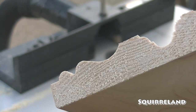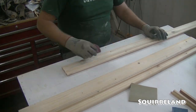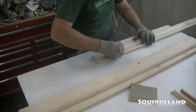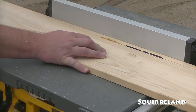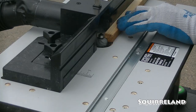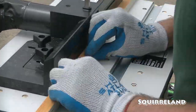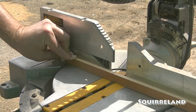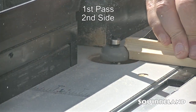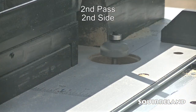Next up are the two trim boards that will be on either side of the panel. The reasoning I have behind this is that I hate visible seams when I assemble my wall panels — it takes away from the illusion when I'm easily able to tell that the room is a collection of four foot wide sections. My solution is to make the seam part of the design and hide it by drawing attention to it. If it looks like it's supposed to be there, the brain won't think twice about it. Since these boards are going from top to bottom on either side of the panel, I have to cut a negative space into the ends of them so that they can fit with the positive cuts on the baseboard and the crown molding. I had to run them through the router table twice to get the cut to be at the desired depth.